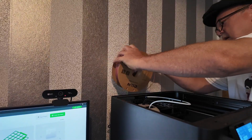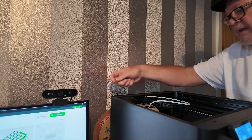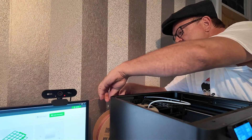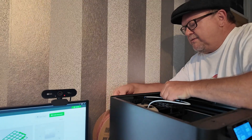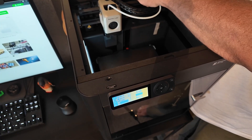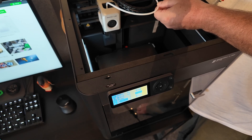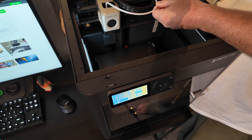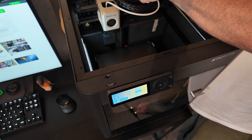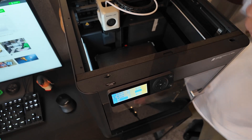Hopefully you can see that. Now you've got this coming up the top here — there's a little white pipe here. Just poke it through. I should really take that bend off I think. I'm just holding this white PTFE pipe because it does move a bit, and I'm pushing the filament through. You can see the colour feeding through there. Feed it through as far as you can. You can sometimes push it too far and push it out the other end. Like so.